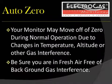During the normal operation of your monitor, the sensor reading may fluctuate off 0 even when no gas is present. This can be caused by changes in temperature, altitude, or the presence of other gases in the air. If this occurs, you can perform an auto zero to reset the sensors.